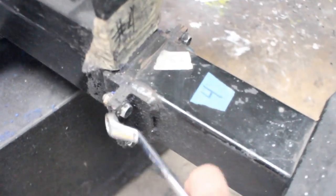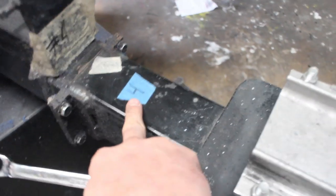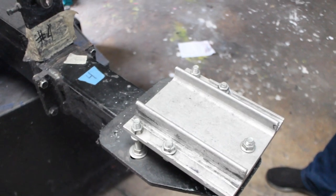There are four bolts here — they're 9/16ths. We've got each of the arms labeled, so just match them back up with the appropriate number and you'll be good to go. There's going to be one 110 plug, and then we have two 220 plugs, and these are just a quick disconnect — I'll show you what the prongs look like.